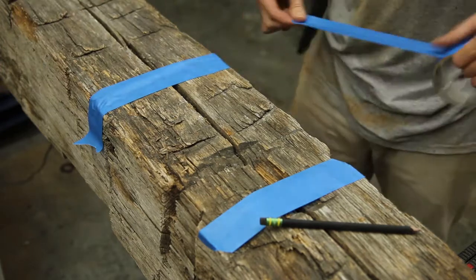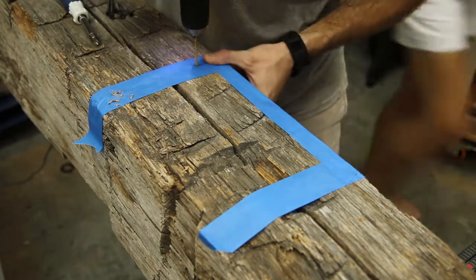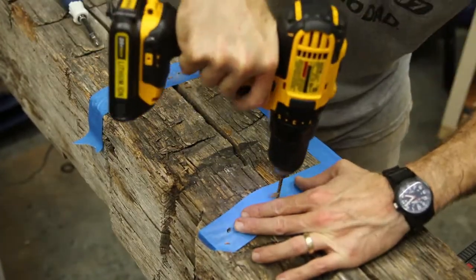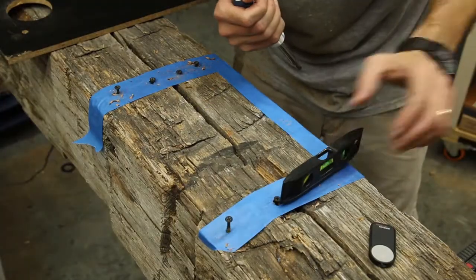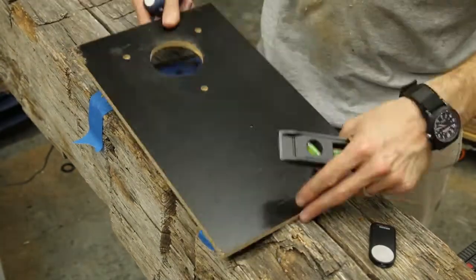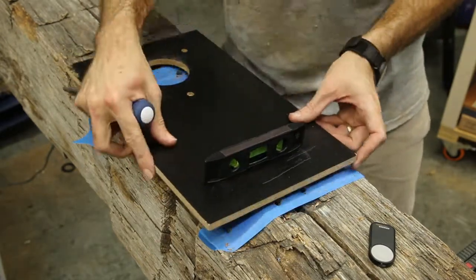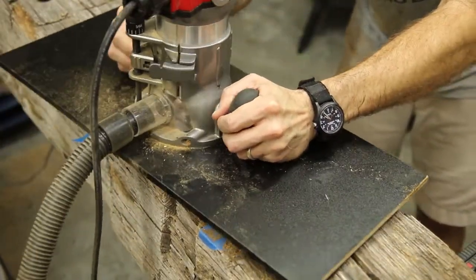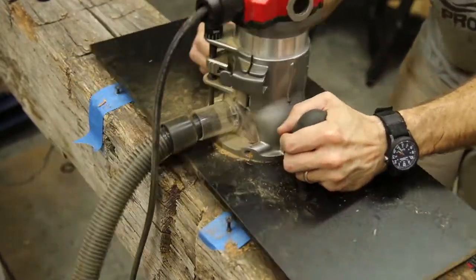Next, for this bench to be stable, I had to use the router to make some flat surfaces where the legs and beam would join. These flat surfaces would need to be level too. I taped off the area to be routed, then drove in a bunch of screws and left the head slightly above the surface. I adjusted the height of each screw so they were all exactly level, using a scrap piece of particle board to check — if the board doesn't wobble and the level's bubble is in the middle, then all the screw heads are level. The process is to let the router ride along the screw heads as it routes away the material — the same concept as those big slab flattening jigs people use on live edge tables. After several passes with the router, I had a flat surface that was also level relative to the top of the bench.